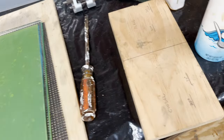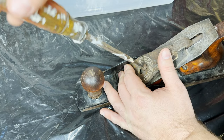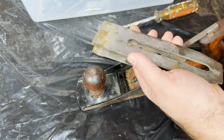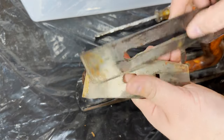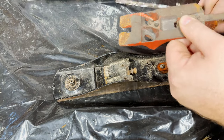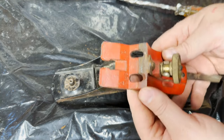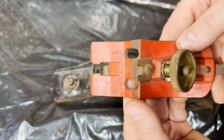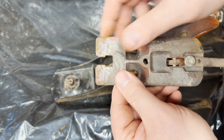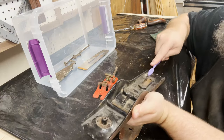Use whatever sharpening system you use — you don't have to do everything the way I do, but it tends to work for me. So first thing I'm going to do is take it apart. You're going to check and see if there's any major defects to the blade or the chip breaker, like any dents in the front or any pieces missing. When you take out the frog, make sure the bottom of it is flat so it sits right. You're also going to make sure the adjustment knob works and take down any markings you see, because you'll be able to use that to type it later on. Do the same thing for the bed — look for any markings on it and check and see how bad the rust is. This one's probably got more pitting than I thought.